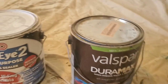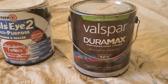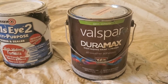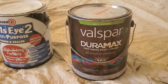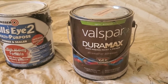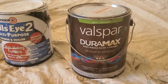For exterior paints — this paint is for the doors here at the 12-unit — the key thing to remember is that even a flat exterior paint has a sheen to it; otherwise it wouldn't be waterproof. So if you go up to a semi-gloss or gloss, it is very difficult to work with. I would recommend you do not go anything past a satin, and even at satin sheen it's still going to have a lot of gloss to it.